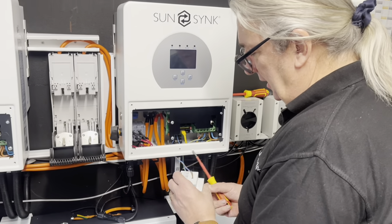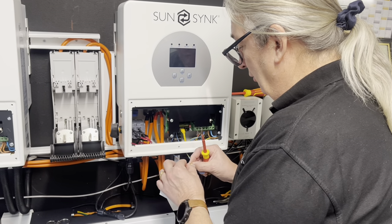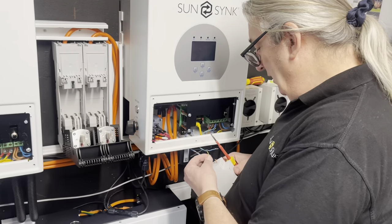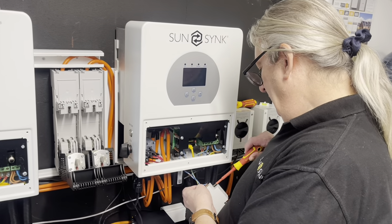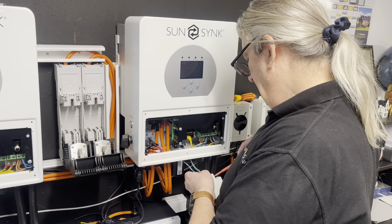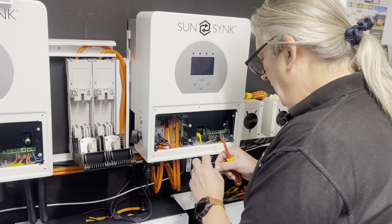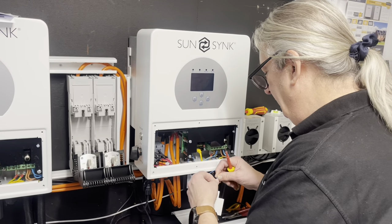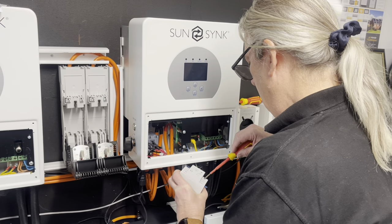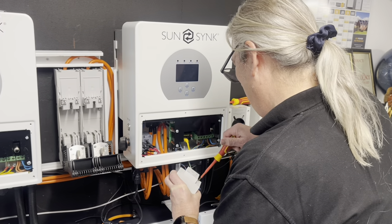You could use the other contactors on a three-phase contactor for an operator light — an LED or a bulb to show when it operates. I'll put the live into A1 and the neutral into A2 — this is the relay feed going through the coil and through the inverter. These two cables here should be much thicker — this is actually a 40-amp relay. I'll put the last wire in. There we go — leave it dangling for demonstration purposes.